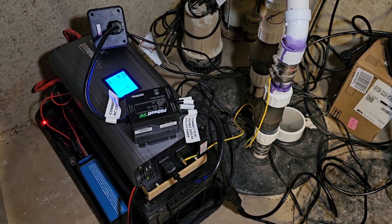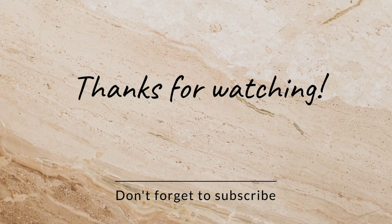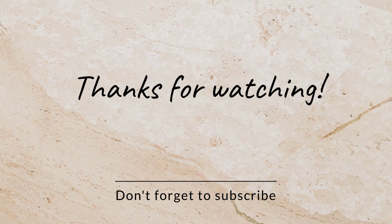I wanted to give a quick summary of why I built this. There are two main reasons: I wanted to use a lithium iron phosphate battery, which I couldn't find a pre-built system to support, and I also wanted to add a smart element. Using my hub and Z-wave I've made the charging more automated — right now it charges about an hour every three days. I also added a weather factor, so if rain is in the forecast for tomorrow it'll charge for six hours to fully top off the battery going into any potential rain.